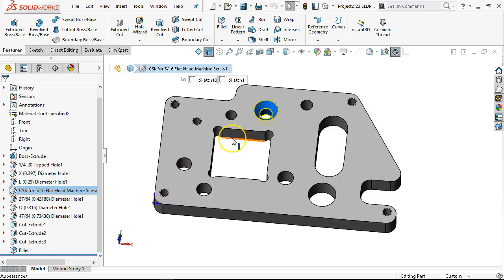From a production standpoint, that whole contour and getting that tool into place — either with the contour or the bore operation — is going to take a little more time than a straight drill. If I'm making a couple of these, I'm saving time on setting up seven different tools. But if I'm going into the hundreds, we probably want to do the tool changes and get more efficient on the tooling.